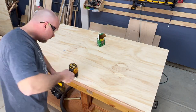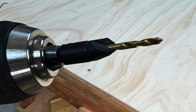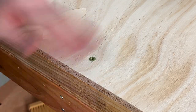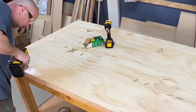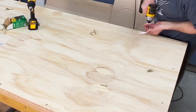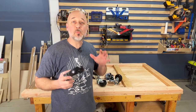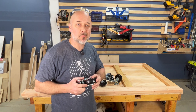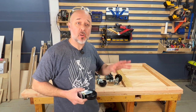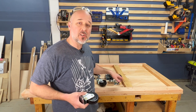I used a fair amount of plywood on this project as well as 2x4s. But anytime I drilled into the plywood veneer, I used my Ryobi countersink bits — this helps the screw head sit flush or even shy of the veneer without damaging it. I'm trying to do this project as economical as possible, so I bought plywood with only one side finished — two pieces — and another piece with both sides finished, saving about 15 to 20 bucks.